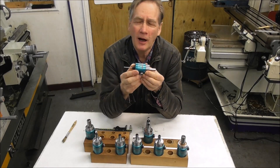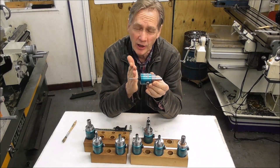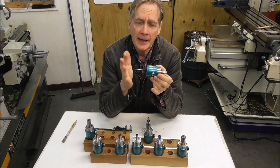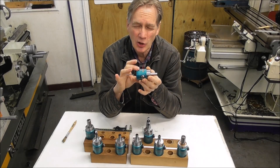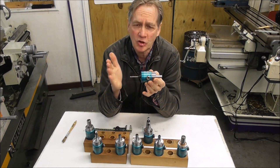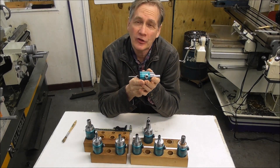If you're not familiar with the Hallmark ITTP, it's called Impact Tolerant Touch Probe because it has a lot of retraction. Traditional touch probes have a fragile self-sacrificing stylus stem that breaks in the event of a crash in order to protect the delicate internals of the probe. But the Hallmark ITTP has over 17mm of retraction in the Z and a lot of retraction in X and Y. I've got videos showing that if you're interested.